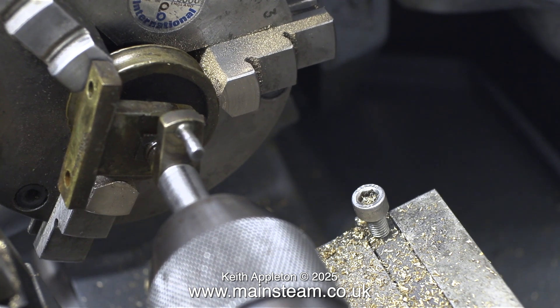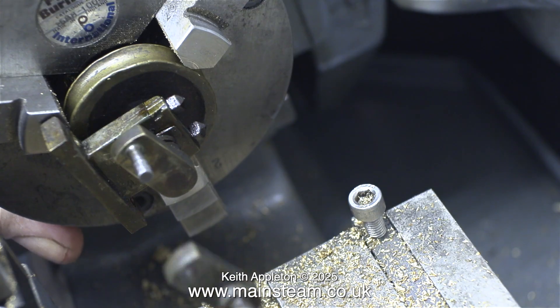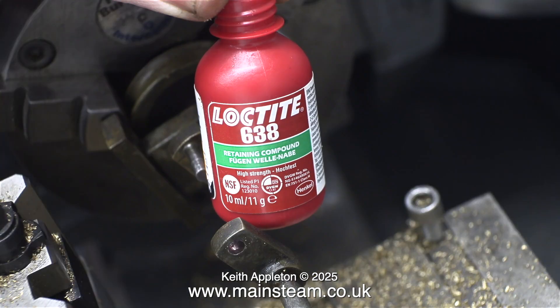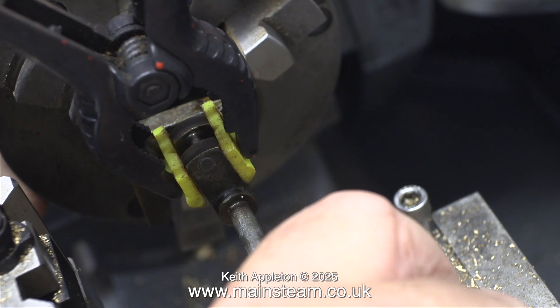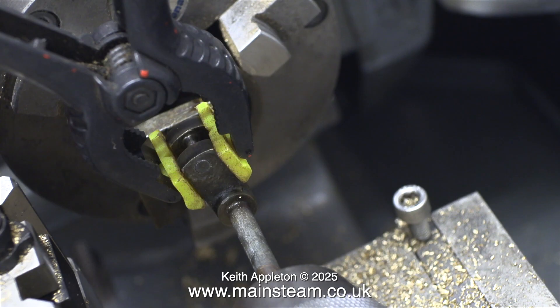The next part is quite scientific and it's almost engineering. I'm using a piece of steel in the tailstock chuck to press the brass pulley into the chuck which is partially tightened, making sure it's square before I apply Loctite 638 — a very strong version of Loctite 601. Any proper engineers watching, I recommend you look away now, because I'm using a very strong spring clamp to hold the two edges of the crank webs together. With a bit of luck these should be okay once the Loctite has cured. I want to leave the Loctite bond to cure fully before I work with it.